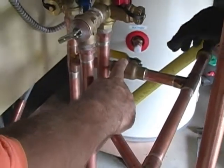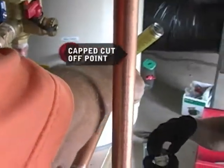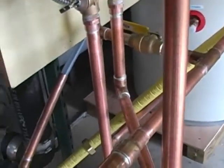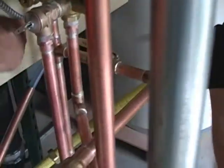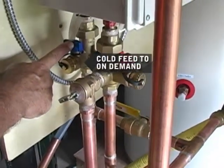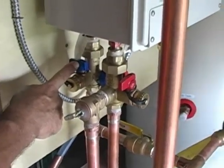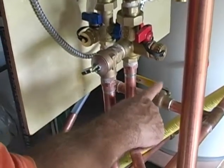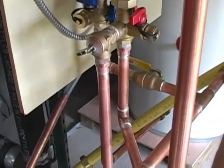When we're done, we'll turn this valve off. This will be normally closed (NC). Then we'll have a cutoff valve down there — those will be normally open. So that cold water feed will come through the heat exchanger, and then the hot water will be the cold feed to the on-demand. However, in the case of a problem or an install where you want to keep running, this is the bypass. Right now the bypass is open and the system can work without the solar feed.